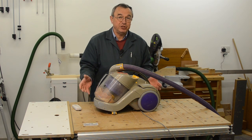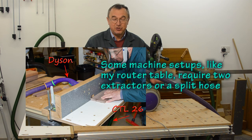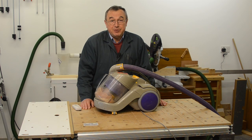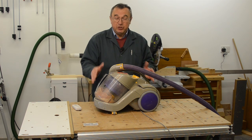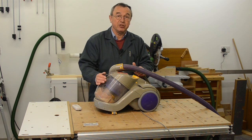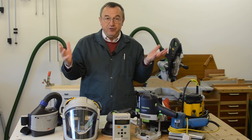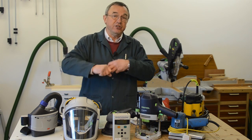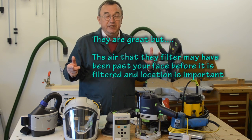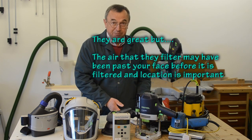You've got to have some sort of strategy in your workshop for collecting dust. You cannot use power tools in a workshop without some form of dust collection. Some people have workshop dust extractor systems where it's plumbed in, and that's a really good idea. If you can collect the dust and debris at the point of its creation using either portable machines or a plumbed-in system, that's great. I've not tested any chip extractors — those things with a cloth bag on top that inflates when you switch them on. I got rid of mine because every time you turn it on, it sends a cloud of fine dust into the atmosphere. I've also not tested any air filtration systems — the things you normally leave running all the time, often in the ceiling of a workshop. They take the dirty air in, filter it, and pump out clean air, and I understand that to be a very good system indeed.